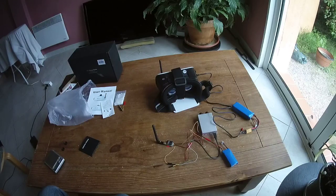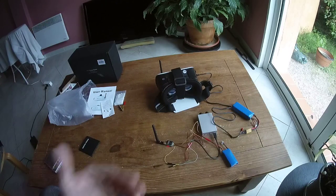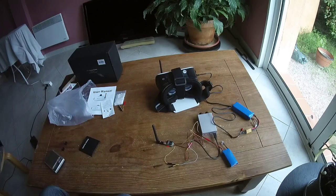So it was an unboxing and quick testing of the RT2 3D Goggle associated with the ColorMix 3D camera. Of course I will try to fly with a racer with this combo, but it will be hard to show you the rendition because I cannot record separately the two channels. Anyway, I will give you my feeling. Generally, 3D stereoscopic FPV is more efficient for proximity flight — when you are very close to the ground and close to trees. But at altitude it's close to useless because you cannot distinguish the foreground from the background; all distances tend to infinity at high altitude. Hope you enjoyed this video. Thank you for watching, see you next time. Bye-bye.